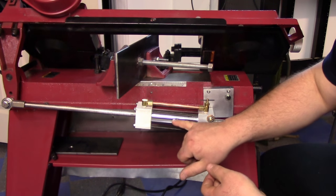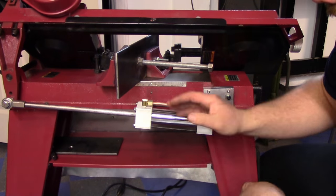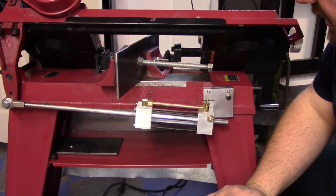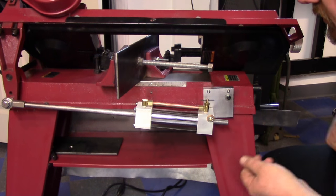Also, some of you had said that when you put the check ball in there, just give the check ball a tap and you'll seal it completely. So while I have it all apart, we're going to pop that check ball out of the bypass and give her a tap with a center punch to make a nice, stronger seat, since we're going to have all this apart.